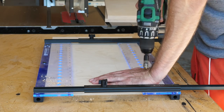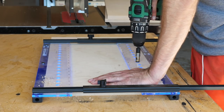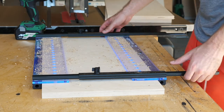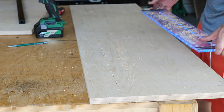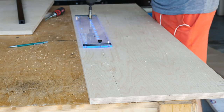Next I used this jig to make a bunch of shelf pinholes to hold the adjustable shelving. I only have a rough idea of what I'm going to store in here, and I'm sure it's going to continue to change, so I just wanted to make it as versatile as possible. The only real trick is that the vertical partitions are narrower than the side pieces, so on the side piece I had to inset the jig a little bit so that everything would line up right in the end.